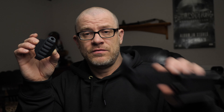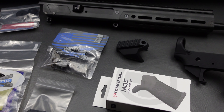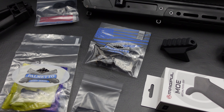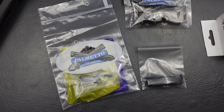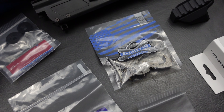This is the adapter, and we'll take a closer look at this here in a few minutes. This is one of the major differences between a standard AR and the Jackal — this is what helps you convert from the standard lower over to the bufferless system. All the rest of the parts for the Jackal are essentially just standard AR parts, stuff you're going to be familiar with, with the exception of the bolt catch. Because of the dimensions on the upper receiver, this piece had to be made quite a bit flatter than your standard AR part — basically the same shape, but a little thinner and more streamlined.